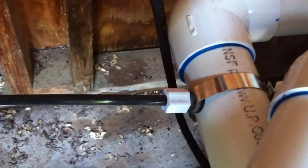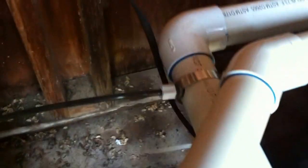Out of the filter we come across here — it all looks pretty nice. Got some rigid pipe going into what looks like a Hayward FDN, probably a 250 FDN heater, one of Hayward's better heaters. In and back out. Right down there you'll see a check valve, which is great. As I've covered in my other videos, that's there to prevent the chlorine coming into the system from tracking backwards through the system and ruining the header on this heater — that actually happens all the time. So it's really great to see that check valve in place.